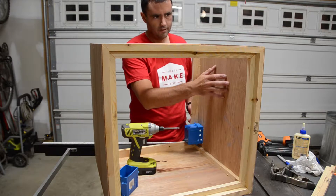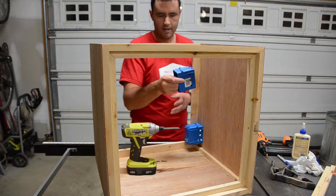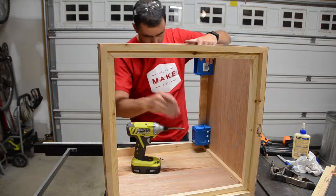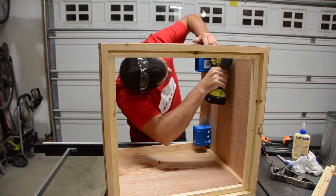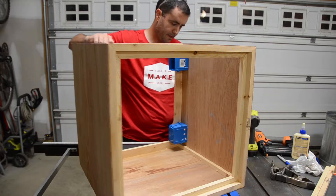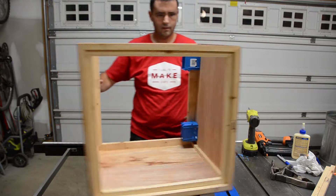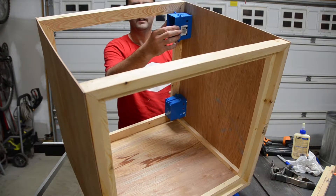So this is anchored in here. This is the bottom that faces towards the floor. The fan unit will be right here. The last piece I want to do is put a box inside that will have a regular single gang dual outlet in it, and I'm going to put that right up here. Once again I'm going to try and drive these screws backwards. So there we have it — the switch is accessible from below as a kind of a safety feature, and this outlet box is where we'll plug in the fan after everything is all set up.